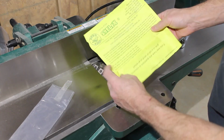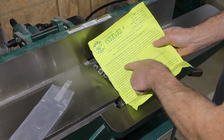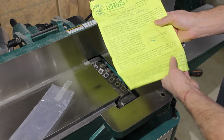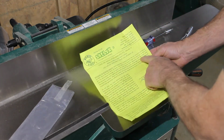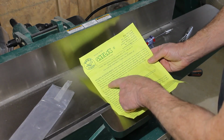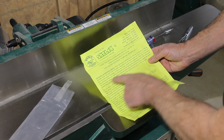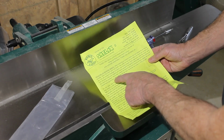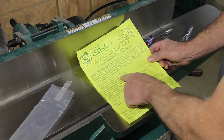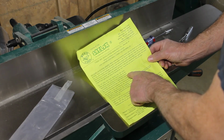Replacing the rotating inserts. Oh, this is 45 inch-pounds. No, wait a minute. Okay, it says hold it away from the back seat and let the screw pull it into position. Do not place the insert directly over the screw hole. Doing this will cause the insert to ride up the back of the seat, keeping it from indexing properly.